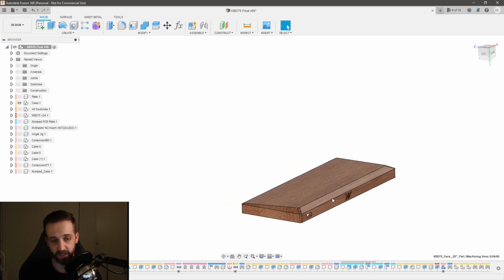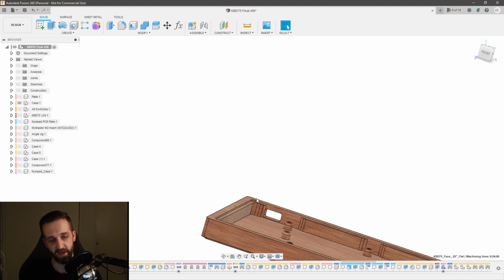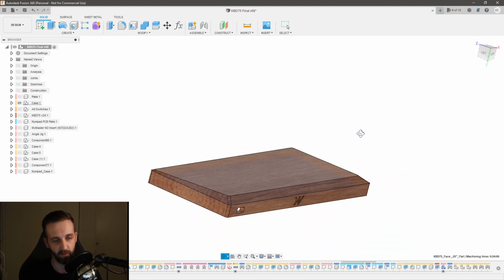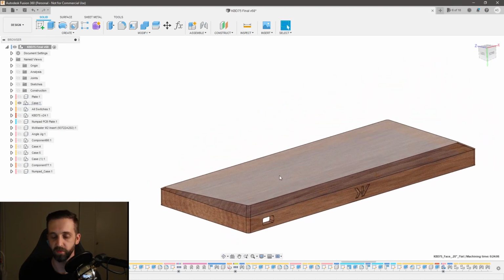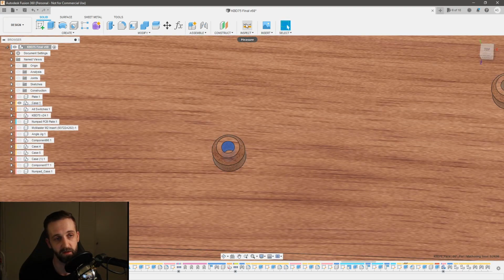Another constraint is that we're going to have to do some tool changes, right? Because we can do a flat end mill cutting into the top here, but on the back side, we can do part of it with a flat end mill, but eventually we're going to have to come in with a bull nose or a round end mill of some sort, or like a radiused flat end mill, and smooth all these out with some 3D contours. So we know that we're going to have at least one tool change.